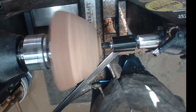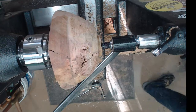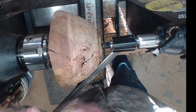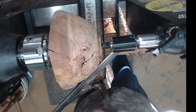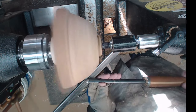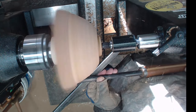Wow, I'm getting a lot of big chips flying off, hitting my hands — not real comfortable — so I'm going to put a glove on my left hand. You hear some people say it's terribly unsafe to wear a glove, but I've got the fingers cut out; it just keeps the chips from burning you. You can also put painter's tape around your hand, but this works for me. Anchor the tool, ride the bevel, lift the handle till it cuts.